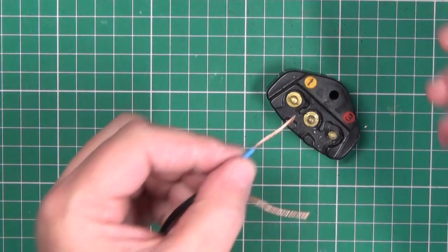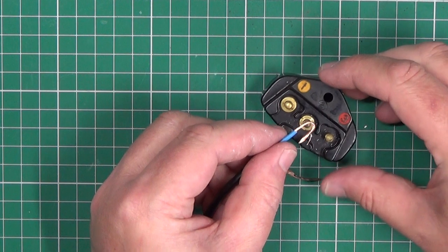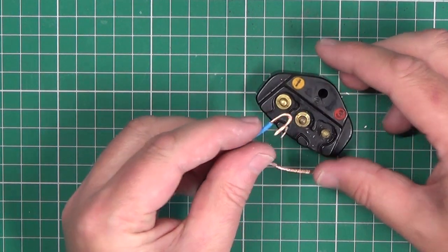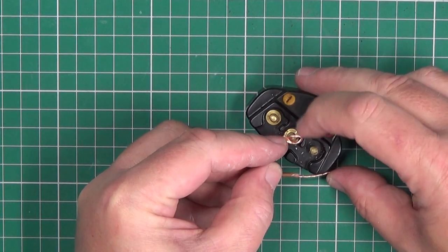One simple solution is to just bend the wires around the terminal posts and fasten them up. Although I really don't find this method suitable — there's a chance the wires may come loose or stray strands can cause a short. Do not do this.